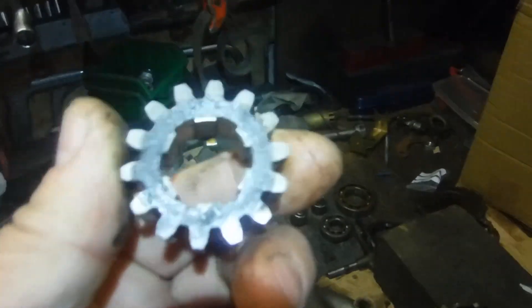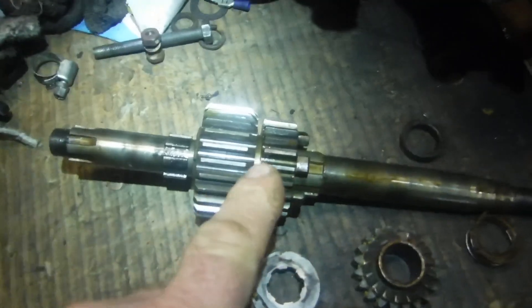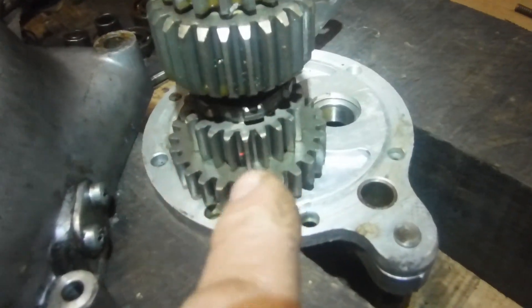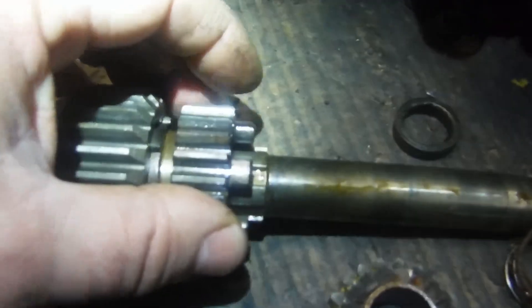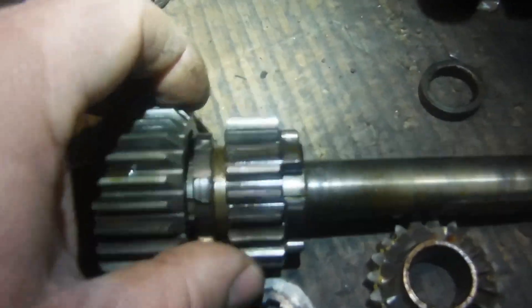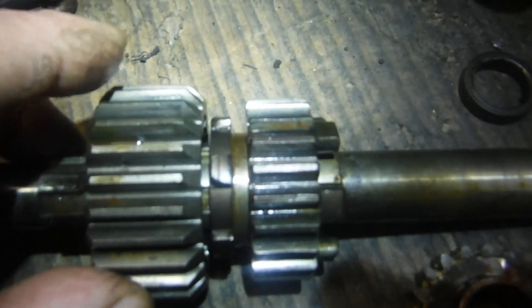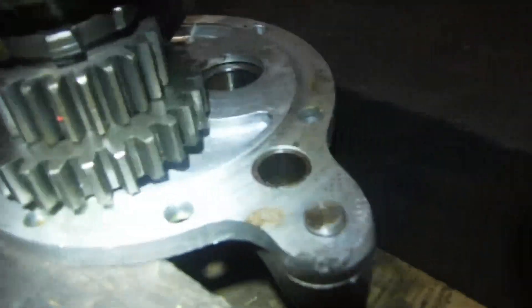I've got a new one of these which will hopefully turn up today. In the meantime, I've swapped the sliding gears around between the main shaft and the lay shaft so that they present good, straight, unworn faces on the load-bearing faces of their engagement dogs. That is as good as you can get without fitting new gears — the worn, badly rounded face is no longer the load-bearing face; that nice square one will be taking the load from now on, and vice versa with the other.